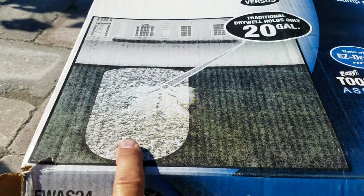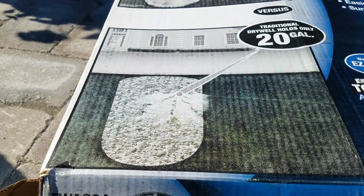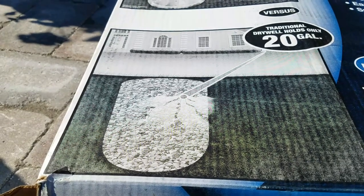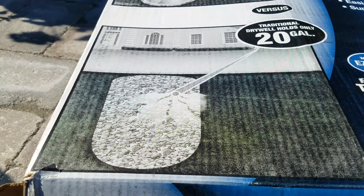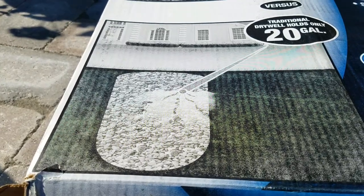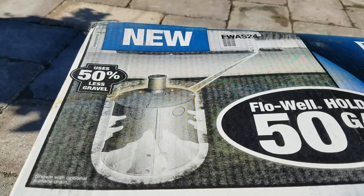This is an example of what not to do: dig a hole, put your sump line out in a trench to that hole, fill it full of stone. How are you going to service a sump line? You might have a collapse, you might have a clog. You're pumping groundwater that's full of minerals — trust me, the day will come where it needs service. You have to snake it. How are you going to do that? If it plugs, you're really done.